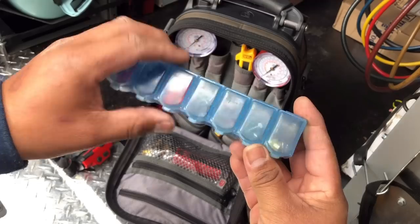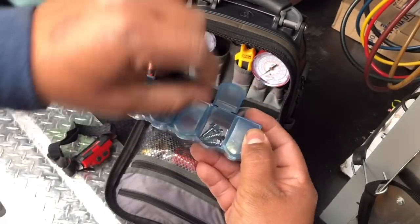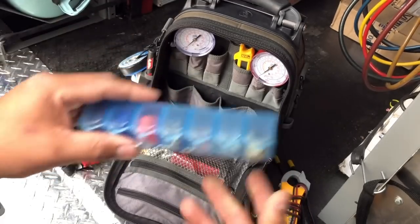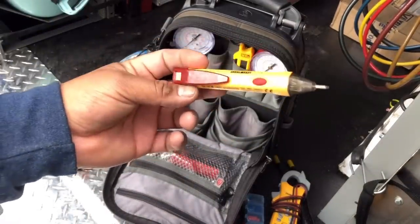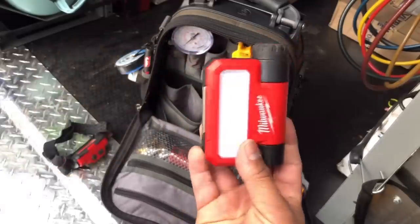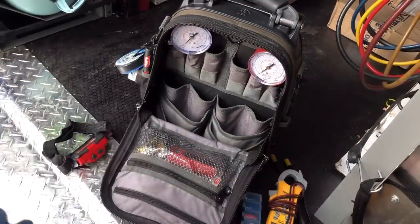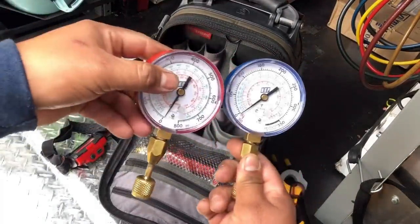I keep minimal tools. I've got some fuses, blue wire nuts, orange wire nuts, spades, a couple screws, and some parts I call jelly beans — I've never seen these before but they're good for freezers when you're changing out sensors. I also keep a non-contact voltage tester, a Milwaukee Rover light — a really good light — and generally two UEI PDT 650s, though I recently left one at a store so I'm down one. Always need some stubbies.